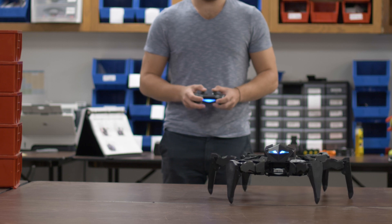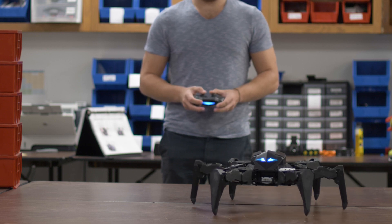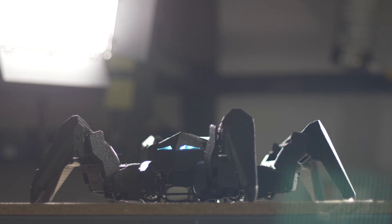The robotics board worked on an older community library that works mainly with Protocol 1 based servos. The hexapod we're using works on Protocol 2, so we're using a low-level API called the Dynamixel Workbench toolbox created by Robotis, in conjunction with the U2D2, to actually control our servos.